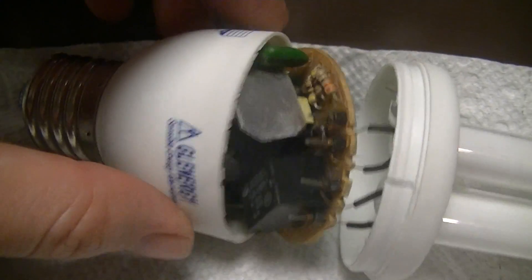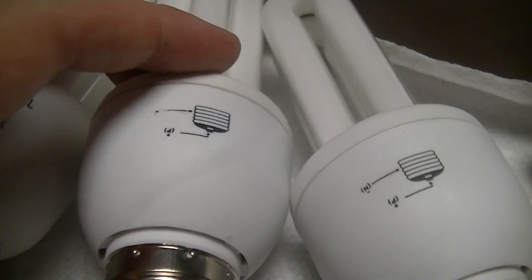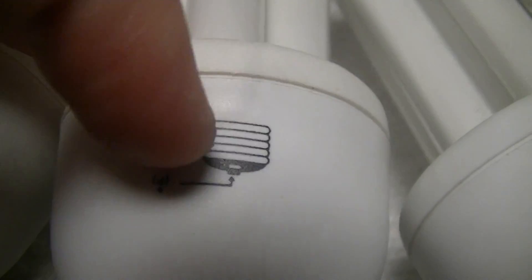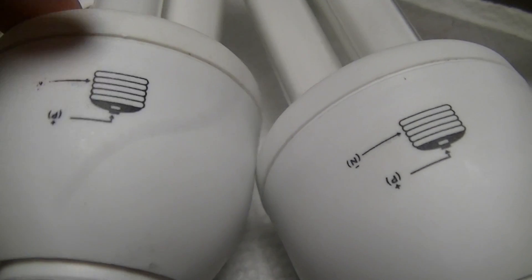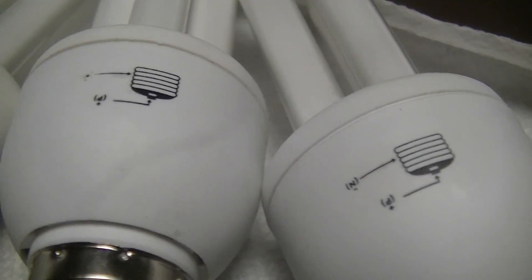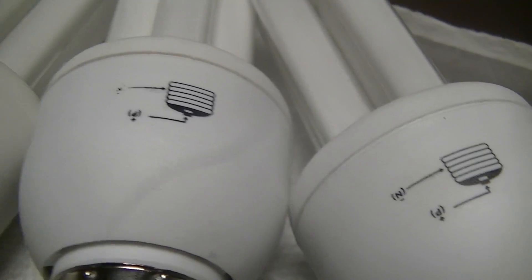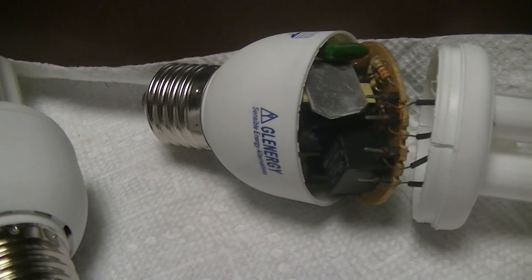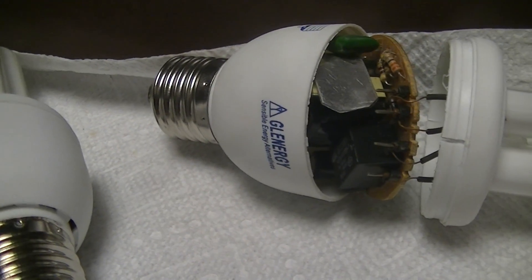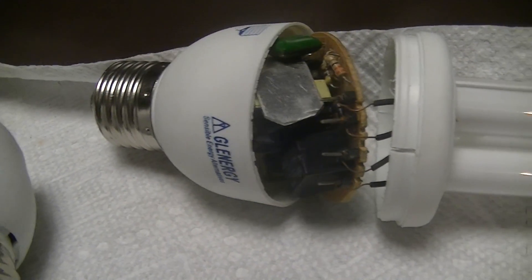Those older lamps are 15 watts, and the biggest ones I got in this particular bunch are 11 watts, like this one. One good feature about these is that because they are DC, they list the polarity on the side of the ballast casing, done pictorially with symbols because these are intended for installers who may be close to illiterate. They also have a Schottky diode in series with the input just so that reverse polarity won't kill them — which is also a good sign.